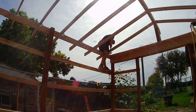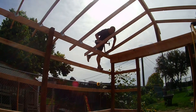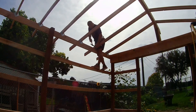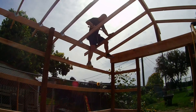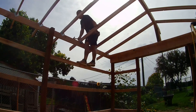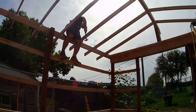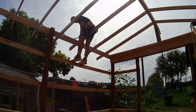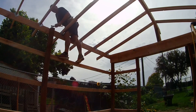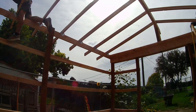I think I used two-by-eights for the ridge beam, which should be plenty for this roof. I made the angle so all rafters could be cut from eight-foot stock with very little waste. This is a high-wind area, so I attached hurricane clips — nailing them off at the ridge and at the bottom. Once I put the last two-by-six at the top, I went around and cut all the four-by-four posts off at that level line, at eight feet, using a chainsaw.